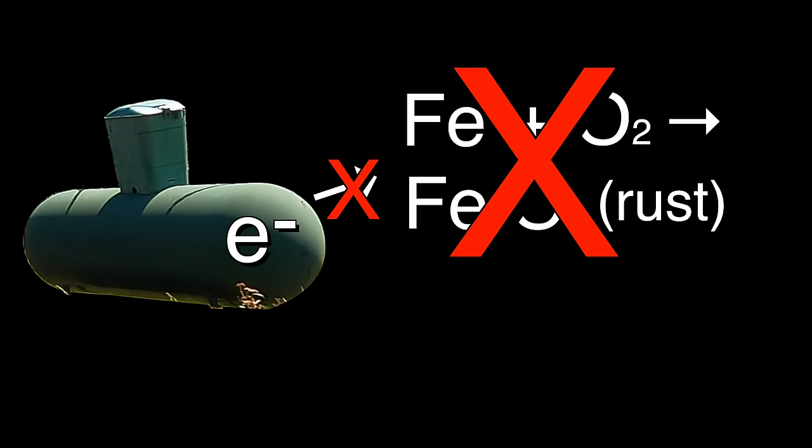So here we're picking up one side of the tank to get it level. And here we're putting dirt in the hole to support the tank on that side to keep it level. We're doing this by hand because there's a lot of rock in this soil and we're trying to avoid the big rocks. If we use the excavator to do this, we certainly would have large rocks against the tank, which is not ideal. And now he's hooking up the anode bag.